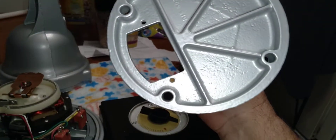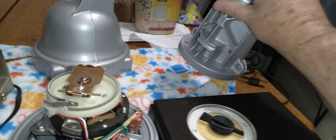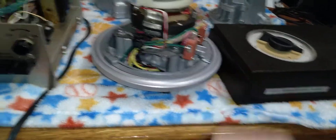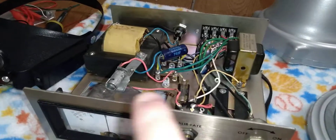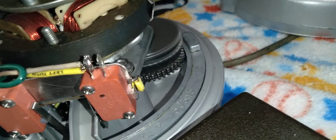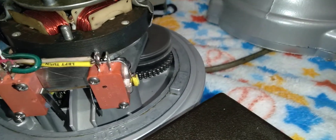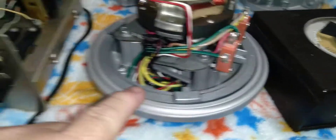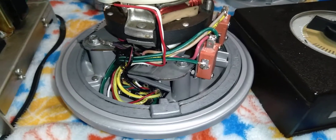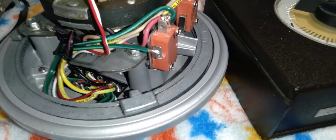There's where the terminal board goes in the bottom — it just goes right through the inside of it and stretches down, and you just mount that on the bottom. That's the latest on my ham radio project. I need to find a 24-volt bulb to go in the meter light. I've had all this apart, stripped it all the way down. Next is grease, bearings and grease — I have to pull all this back apart again to grease those gears. The bearings will go here. Put this ring gear and grease the gears. That's going to be my next step with the bearings.